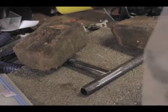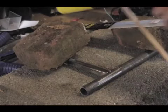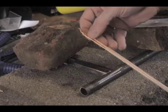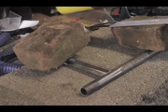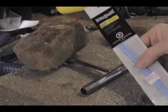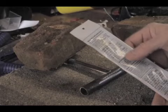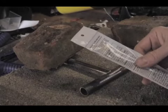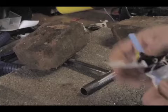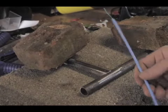You really don't get enough brazing rods when you get this kit. They include maybe six or eight rods — two look like brass, two look like copper, and one is a flux rod. It doesn't tell you the specs. You can get a separate kit on the same shelf: it's called NS3 nickel-silver brazing rod, flux-coated, used in joining carbon and alloy steels. You can get the specs off the shelf, not from the kit — so that's another additional purchase.